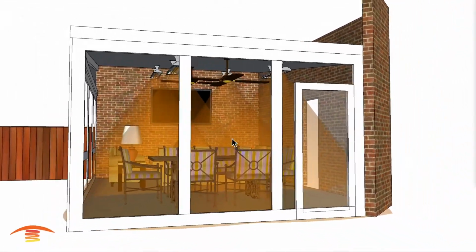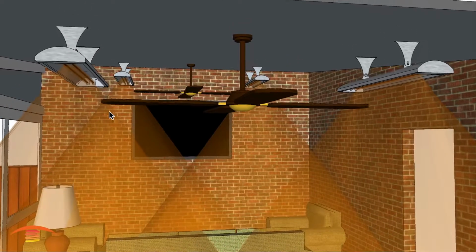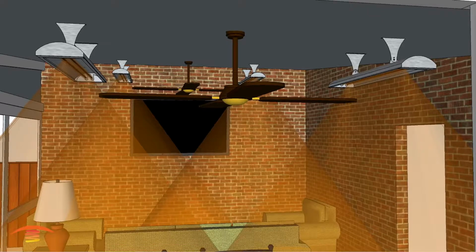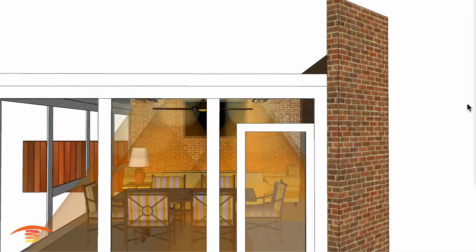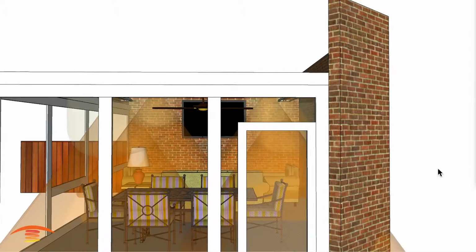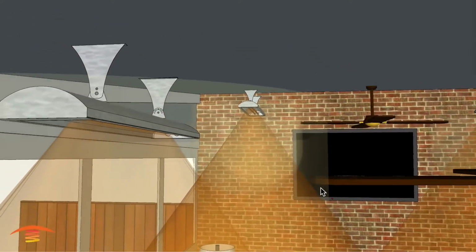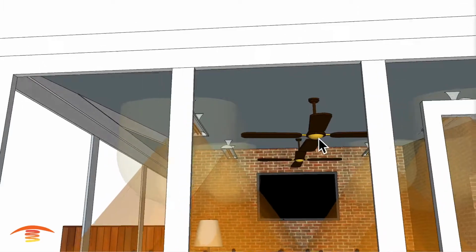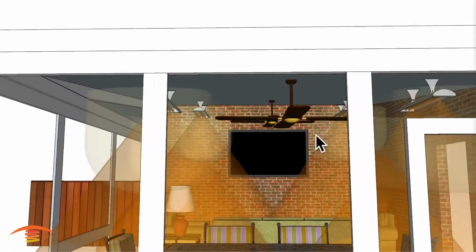And you can see that we have the issue now with regards to the heater penetrating the fan blades. That's not meeting the clearances to combustibles. So again, if we were to put the clearances on there, you can see that is not going to work. So the only thing that you could do is possibly just change the units. With fans, you need 18 inches from this edge to the fan blade here. And I have these fans at roughly about 5 foot diameter. On the left side, that's not a problem. It's just here in the center that we need to move the heaters further away.